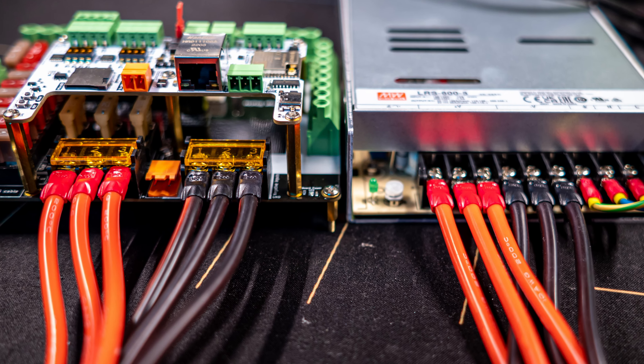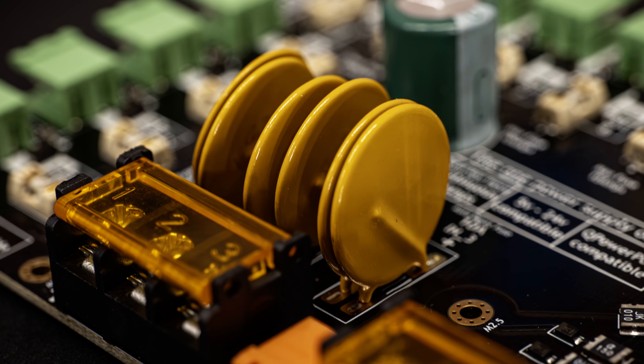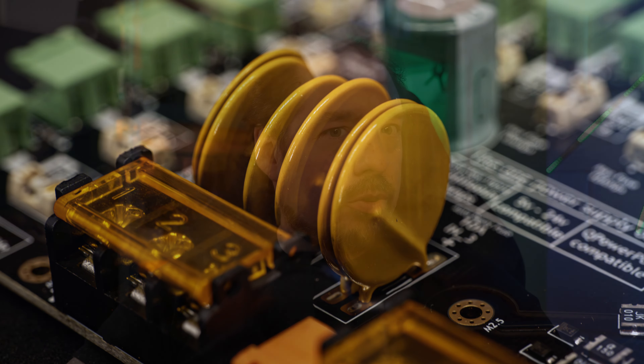Using that thick of a cable is a bit less important on this board since you'll generally be using less amps because of the higher voltages. The Dig Octa system is a bit more advanced than the Dig Uno and Dig Quad in that, next to output fuses, it also has input fuses. The input fuse stage for the Power 5 HV is a bit different versus the other boards — instead of using normal replaceable fuses, it has three times 10 amp auto-reset fuses. This means that if you only hook up a single wire from your PSU to the board, you'll be limited to 10 amps max. Using the auto-reset fuses does have the advantage that they'll actually load balance the incoming power over the wires a little bit, so that's a cool feature.